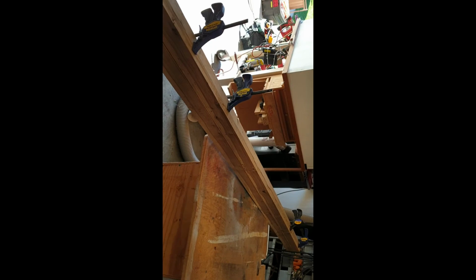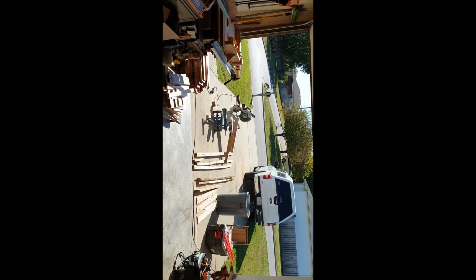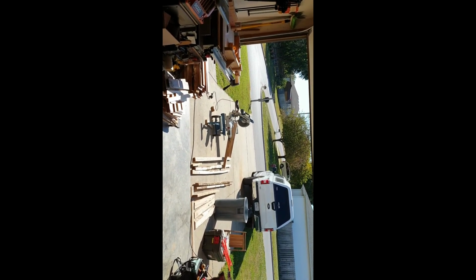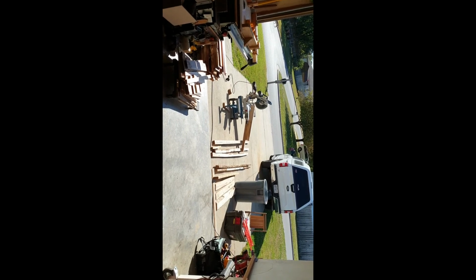Well, it's rough wood, so I'm trying to make it to where I don't have to plane it any more than I have to. I want the roughest part of it to go. Trying to make those dimensions out there. Those are the 1/2 inch parts. I've made them about 3 foot long. I'm going to resaw them on my bandsaw. At a 1/2 inch level, there'll be about 3/4 inch, and I'll plane the one side and try to leave the other side out. And my boards are getting down to fewer and fewer.